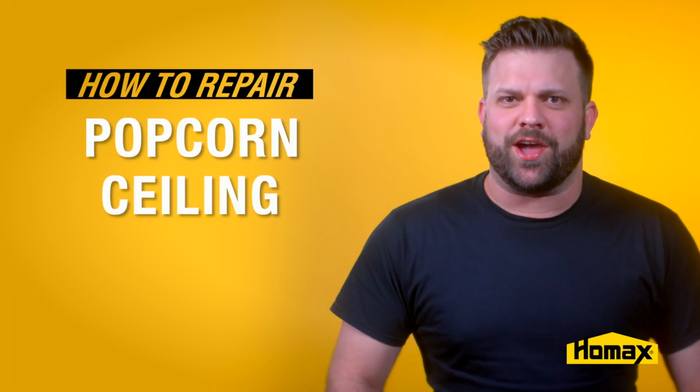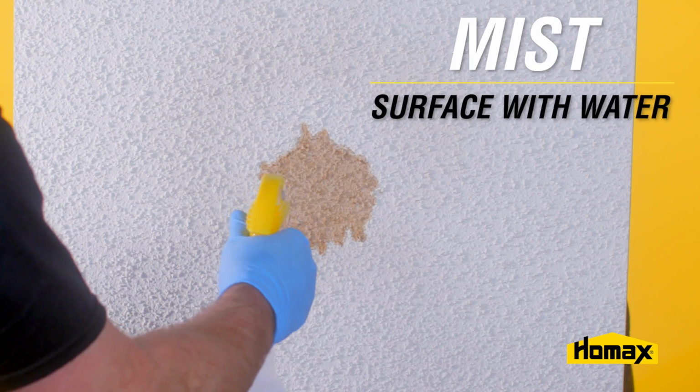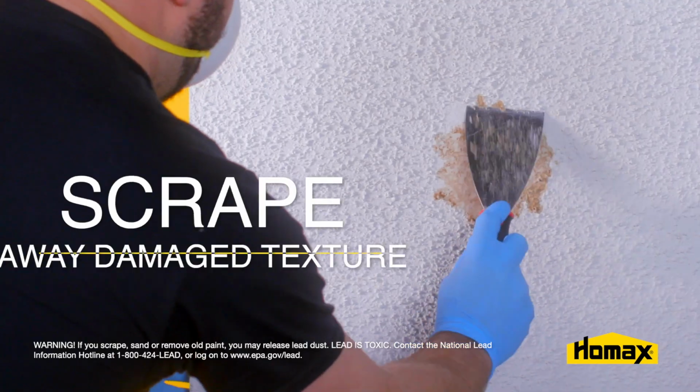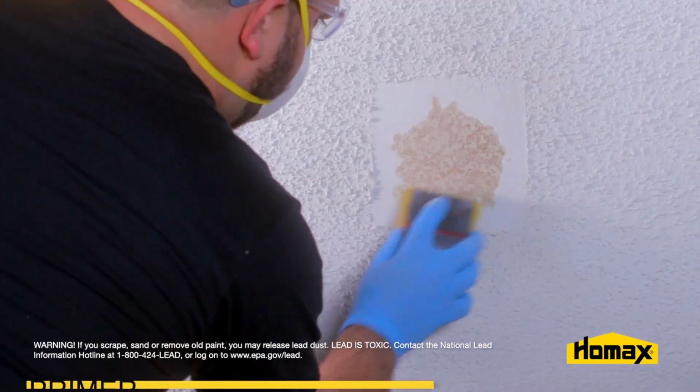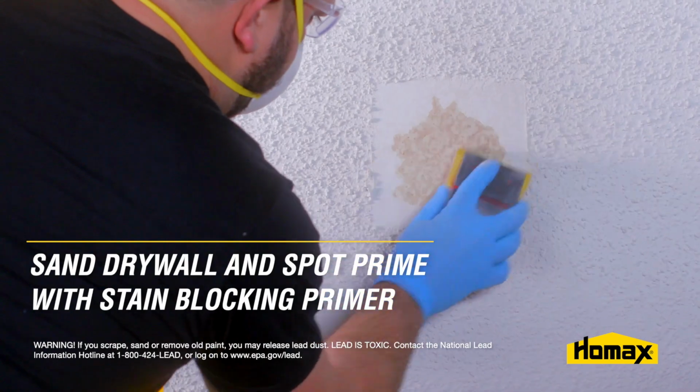Here's everything you need to know about repairing a popcorn ceiling. First, you want to clean the damaged area by misting the surface with water, scraping away any damaged texture. Next, you want to sand the drywall and spot prime with a stain-blocking primer.